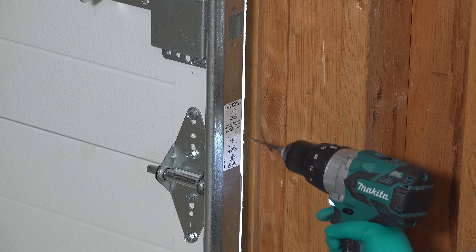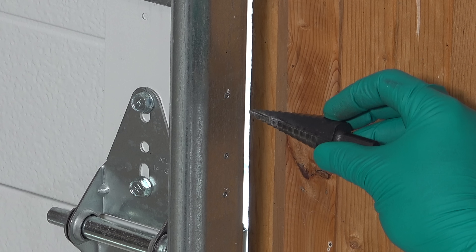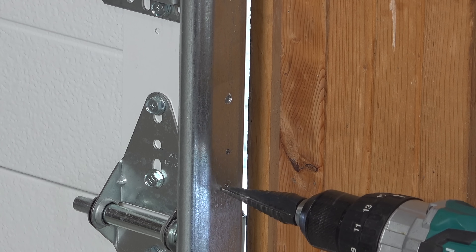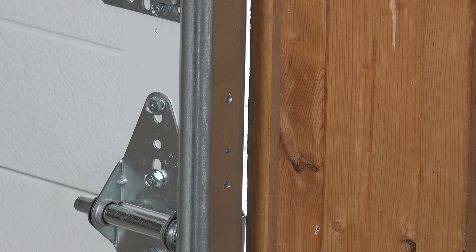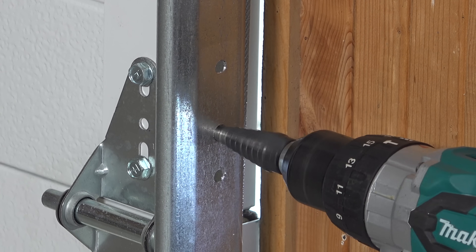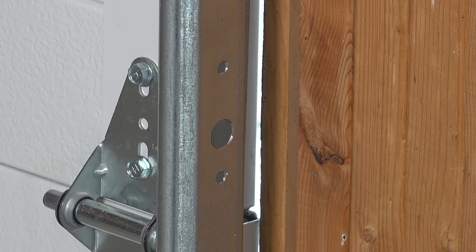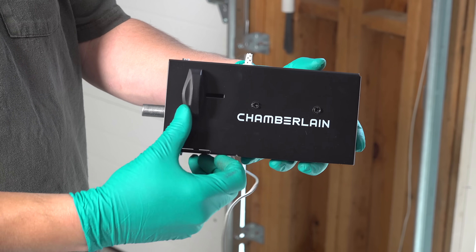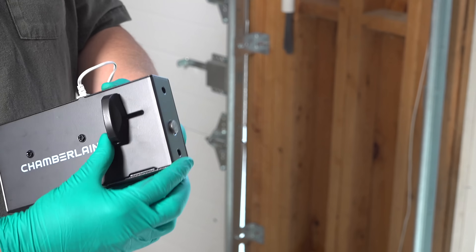You may have to drill a hole in the side of your existing bracket system, but that's easy to do using the included label. You'll drill three holes in total — two small ones for the mounting screws and the middle hole for the deadbolt itself. By marking the metal first with a punch, it's easy to drill with a small bit. To enlarge these holes, use what's called a step bit. This will give you a really clean result and you can keep stepping the bit into the hole until you get the exact size you need. With our holes in place, screw the deadbolt into position.